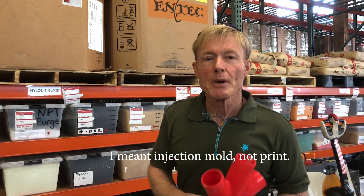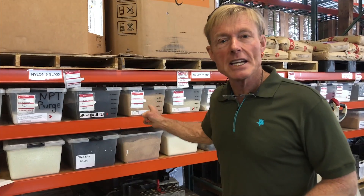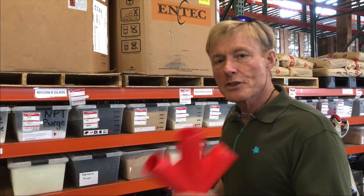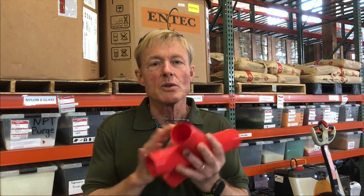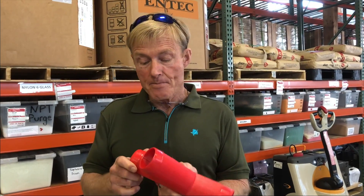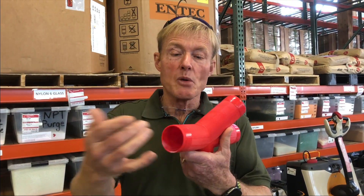This glues together okay, but to make these in two pieces FastCap would need to add ABS material. They've moved away from that, using other materials to keep costs down and consolidate how they build things. So they would have to add ABS back into the mix, because ultimately this would need to be made via injection molding — you can't 3D print items like this and get them to market affordably. For injection molding, there are two options: they can do it in two parts out of ABS with labor to glue each one together, or injection mold it as one piece.